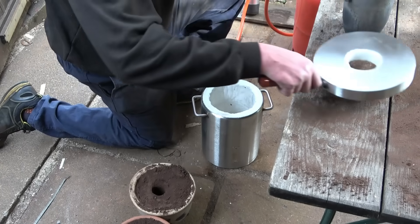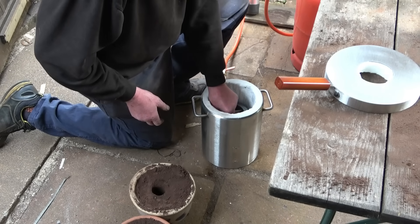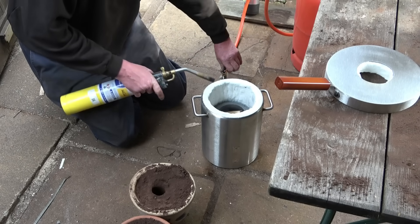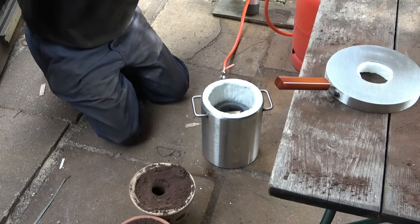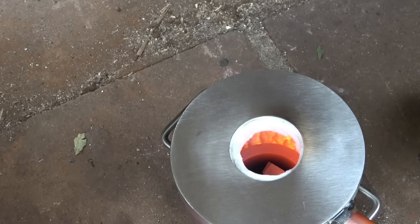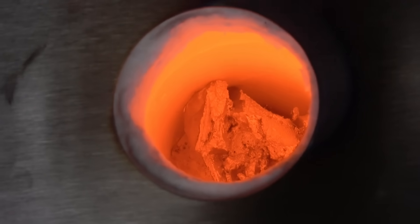With a little piece of cardboard in the crucible, I've got it full of bronze scrap. Warming it up slowly - not a race. It's warming up quite merrily. You need about 1200 degrees centigrade to melt bronze, and it's definitely starting to melt in there.